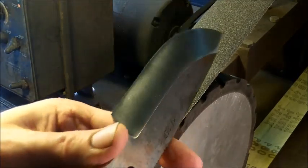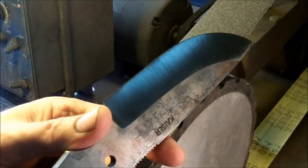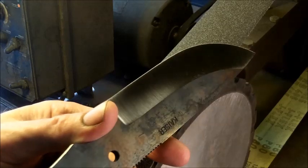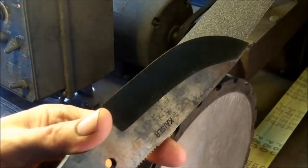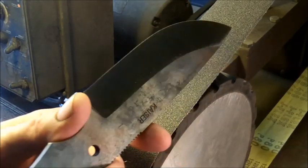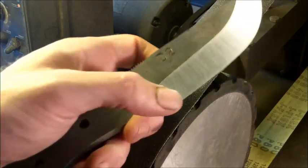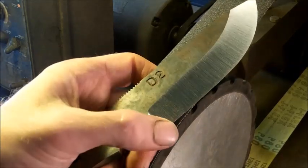And this is the part that kills everybody. It's really, really hard to do, especially if you're going to do it by hand. A lot of people use CNC machines now. They barely even do this type of work. But if you are a garage knife maker, you're going to have to learn how to do this if you want to have good looking blades. Now, I started with a 36, I went to 60, and now I'm at 80, okay?